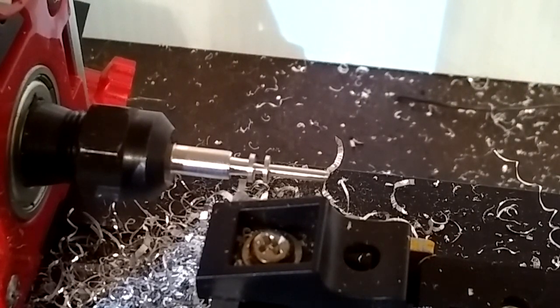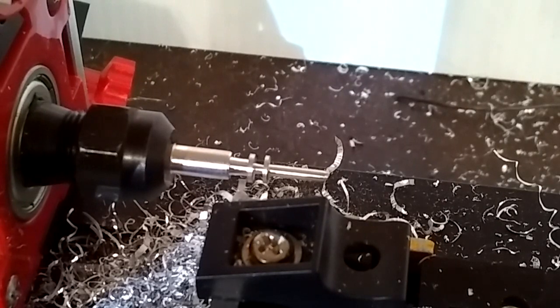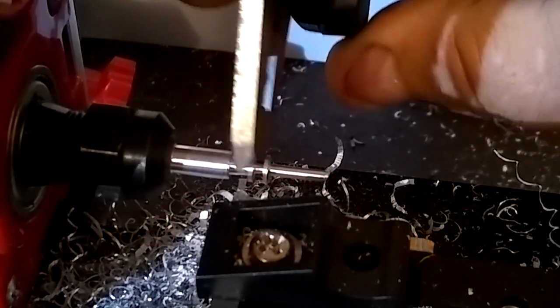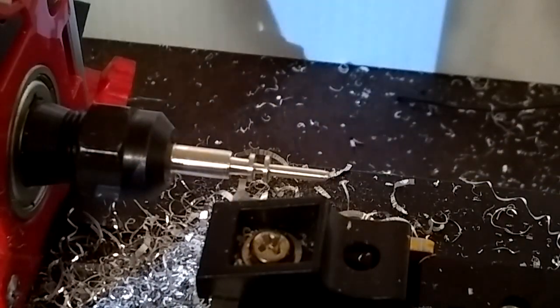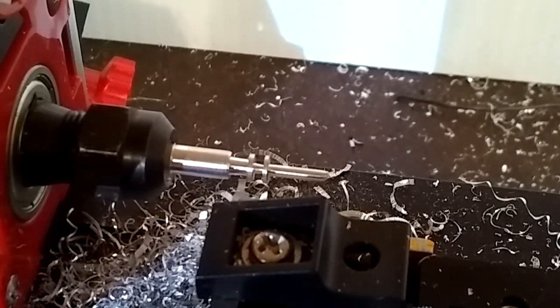And like I said, when you get back closer to the spindle, you can take heavier and heavier cuts, and just get more and more rigid. So let's see what this is real quick, get a reference. And like I said, I think we're going to try to make it 111 thousandths. Okay, so we're at 115. So that ain't too shabby. So let's continue on.